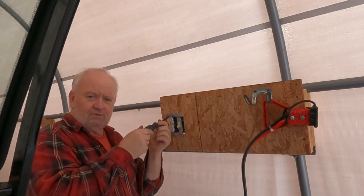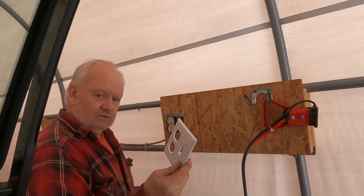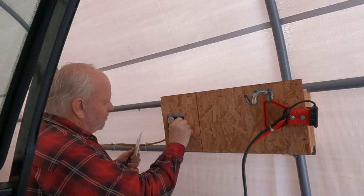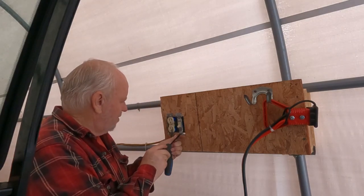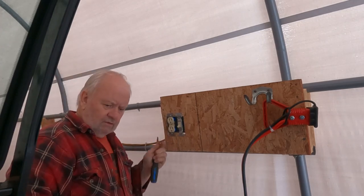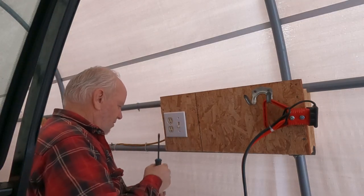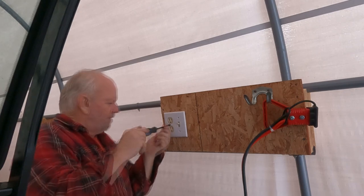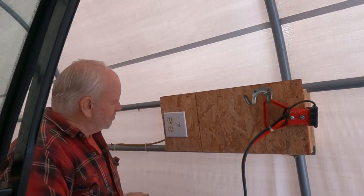But I like 'ground down,' so that's why I put them in. I guess the important thing is, in your house it's nice when they're all the same. I'm not going to tighten that up real tight just yet because I have this switch plate cover to go on it, so you leave them loose so you can adjust them. See, this switch has to go over a little bit. There you go, that looks pretty good right there. So now we can snug them down a little. You don't have to be savage when you're tightening the outlets in the box — just as long as they're snug and don't move around. I like to put the screws so that they're vertical — go until she's just about tight and make it vertical.